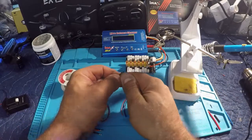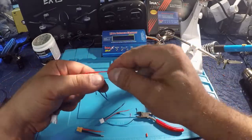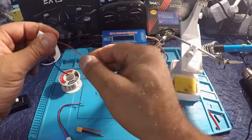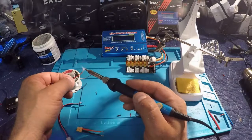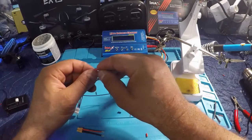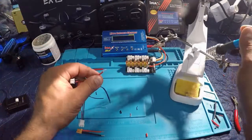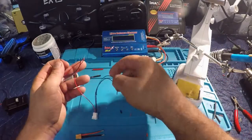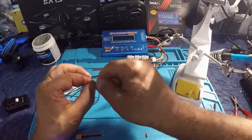We'll prep all these wires. We've got all four wires here stripped — just give them a little twist. We're going to dunk each bare end into some flux, then add a little solder. We're going to put them together like this, give them a little twist — red to red. Please don't critique my soldering — I'm no expert by any means, but I get the job done.